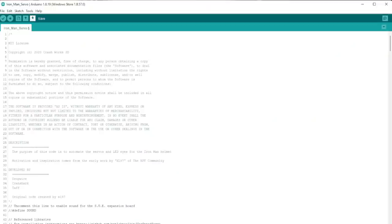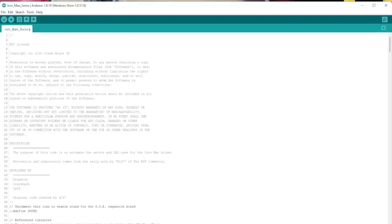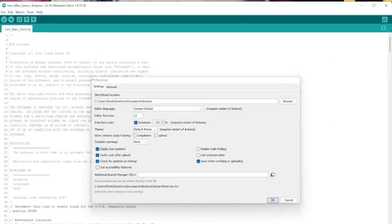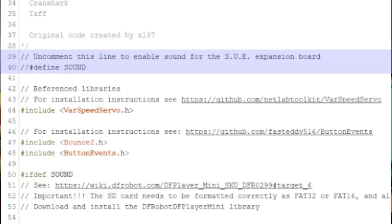That's it — if you wanted to, you could stop the video right now and wire this into your helmet. But let's first make sure it uploaded properly. We can literally watch the Arduino work live. Go back up to Tools, go back to Serial Monitor, make sure the baud rate is 115200 — and right there: 'servo down, start movie, blink.' That means our sketch uploaded to the Arduino perfectly. It's doing more but it's not being told to do anything else right now because we don't have any wires hooked up.